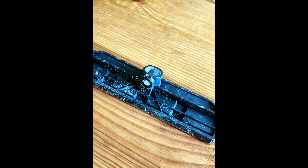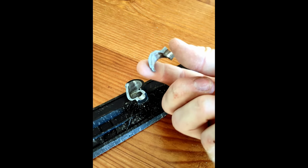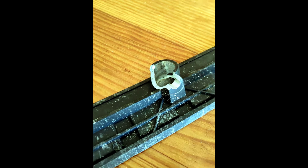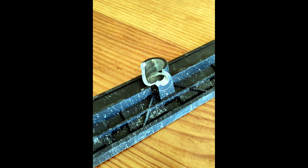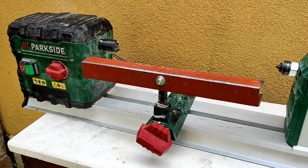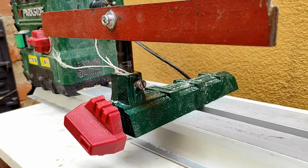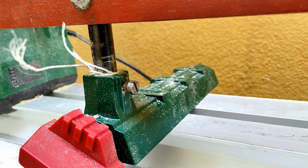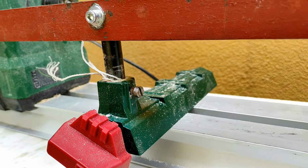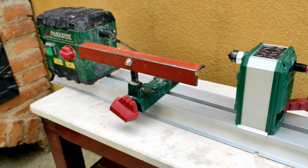Finally, it cracked. The holder is made of alloy, which is brittle. Therefore, I expected the whole wall to be thicker. However, I was wrong. In the end, I made the holder myself from materials I found at home. I used a screw with a large diameter for locking. I sealed the gap with a plumber's string.